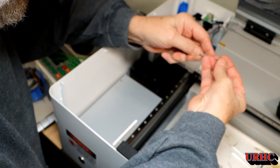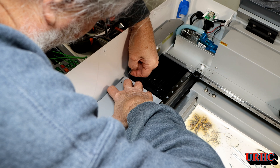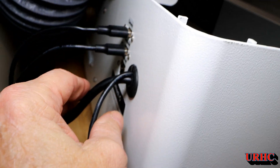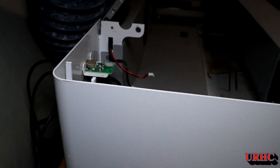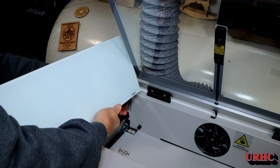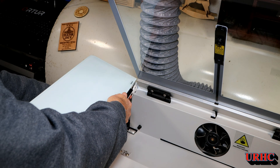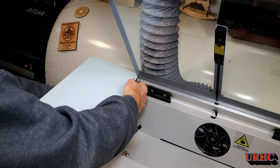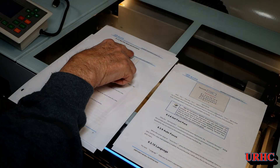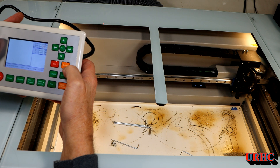Now it's time to throw the cover back on and put the screws in. This machine really isn't that bad to work on — they used a lot of standard parts. I put a grommet in and actually put a second grommet inside to fill the hole tightly. Wires are tied back to the others. Two plugs in the back — one for the limit switch and one for the light strip. The light strip one was a bit tough to get back through, but it goes.